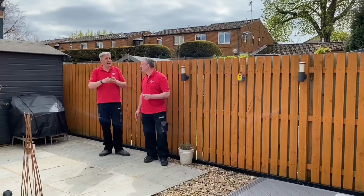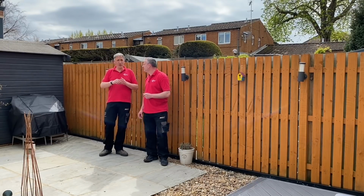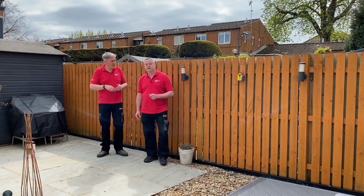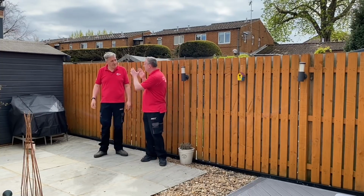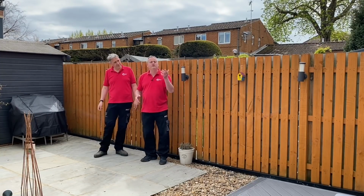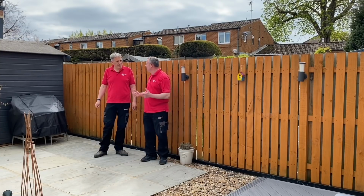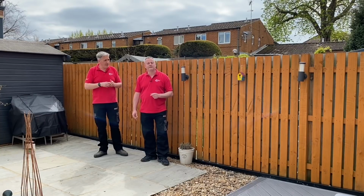But that's where again the Zappi comes in, because we mentioned current transformers. So the Zappi not only handles one, but actually can handle 3 current transformers. That means we could remove the cable that's currently feeding the Zappi EV charger and move it into a home bar area where a consumer unit's been fitted, and then it can manage the current load between the bar area and the EV charging point. Yeah, so again, that's another future-proof option that's built into the Zappi.